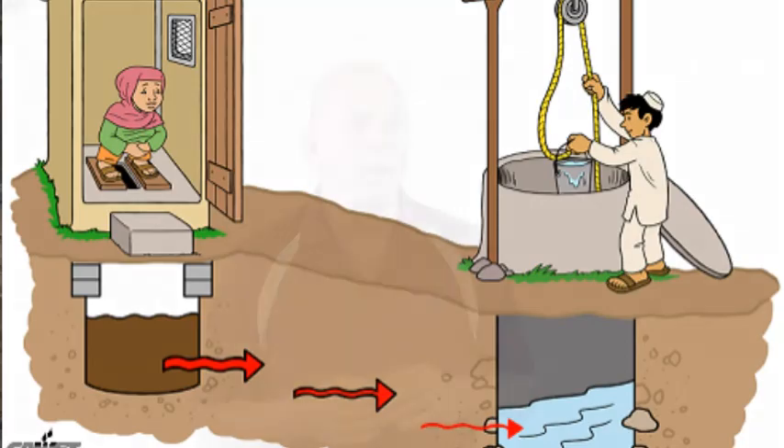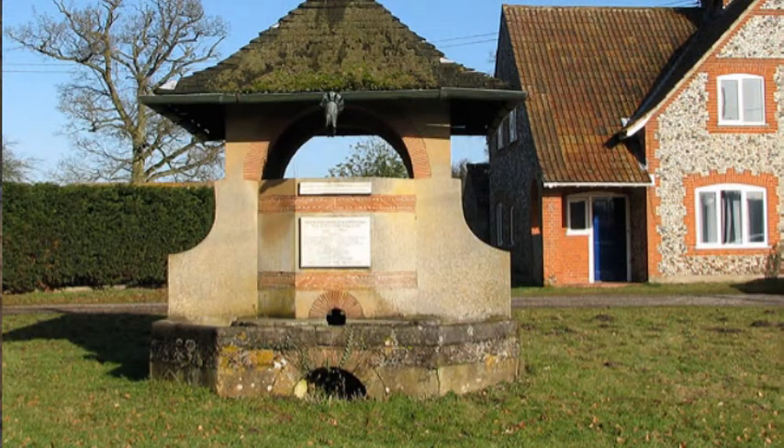Another thing as relates to depth: you don't want the well pump right at the bottom of the casing, because you'll suck up sediments, dead mice, grasshoppers, worms, and whatever else settles down there. To avoid that, you go about 10 feet off the bottom — that's where the pump should be. This is very technical and probably beyond what a realtor needs to know, but it's helpful to have on your radar.